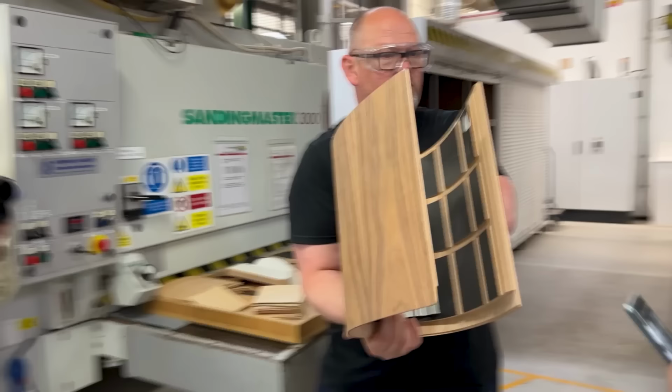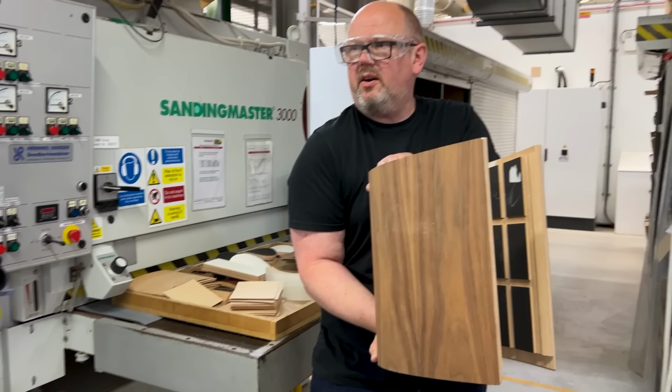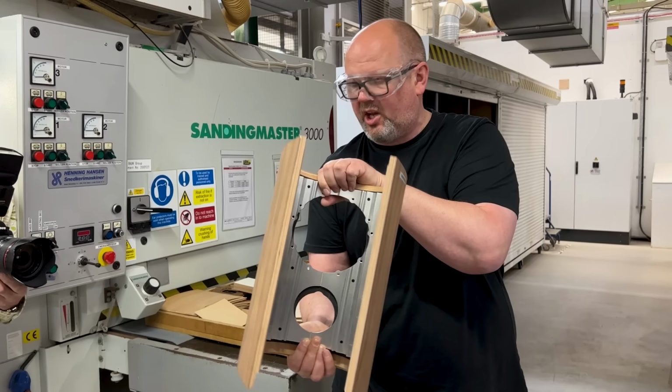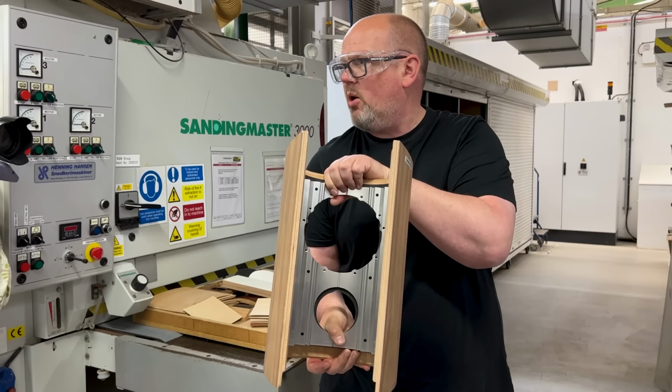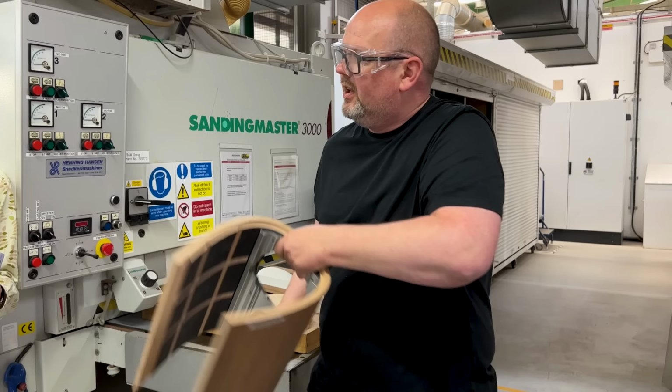No problem. Now the size of the aluminium plate will vary depending on the size of the drive unit. Obviously, certain models only now have the front firing port, so on most of them, you won't get this lower section. It will only go around the drive units. Equally important point to emphasize though, is we don't put it everywhere. There's no hole in the side of the cabinet. We only put it where we've created a weak point in the structure. That's why it's only here, not for example here, right?